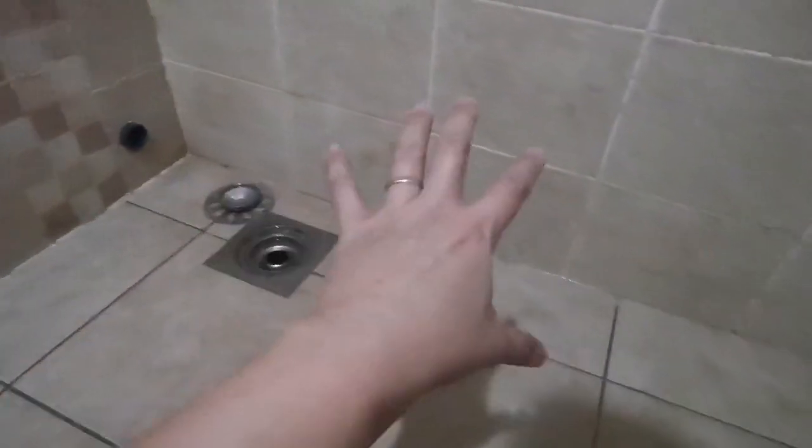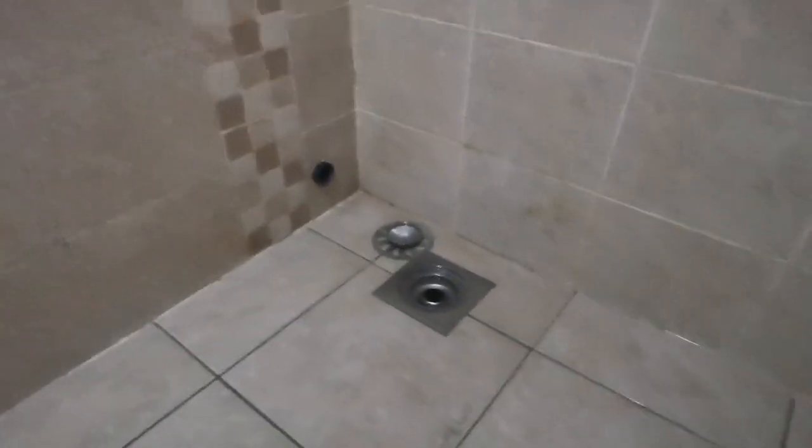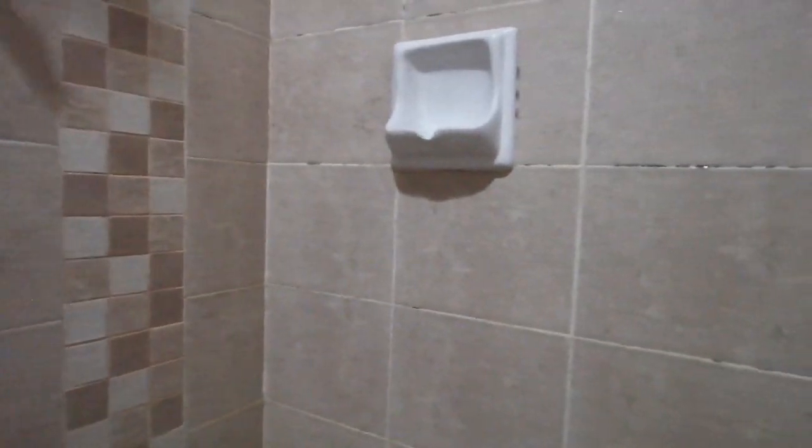I believe this is where the water seeps in and causes the leaking under this, which is the second floor, to the first floor itself. So all these holes and cracks need to be filled up with filler. Yep, so let's perform a proper cleanup. We put filler and then we put sealants to block it.